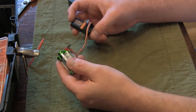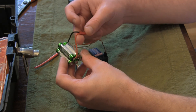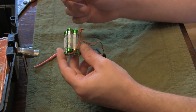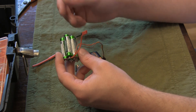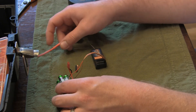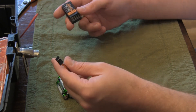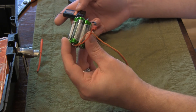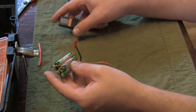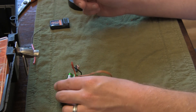I need to recharge this battery pack. The reason you put a JST connector on here is so that if you have a smart charger or even a plug-in-the-wall charger off of some other model, you just plug it in. These aren't very sensitive to charging — you can just amp it up and let it go; it charges really quick. I've bound all of my receivers already using this pack. These NIMH batteries do have some self-drain, so they don't sit for a long time with a charge, but keep them charged up once in a while. They don't really go bad either, so that's a good thing.